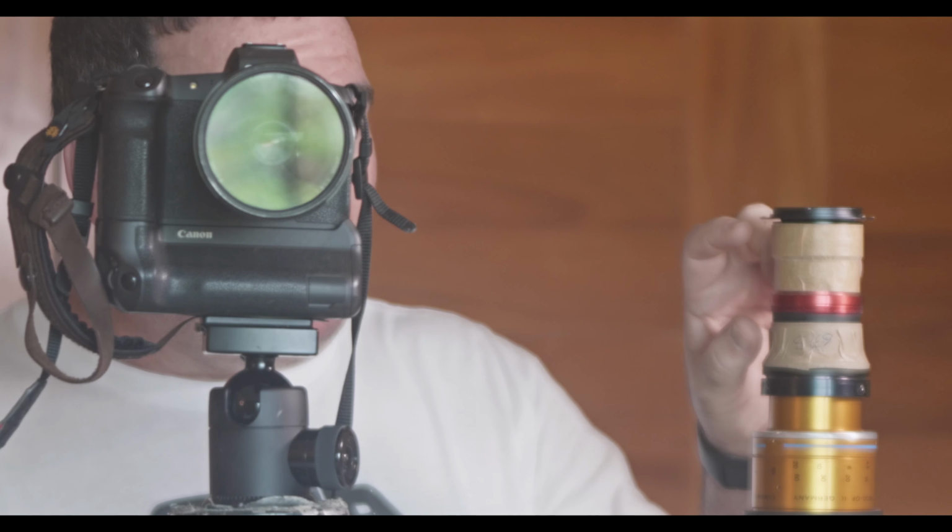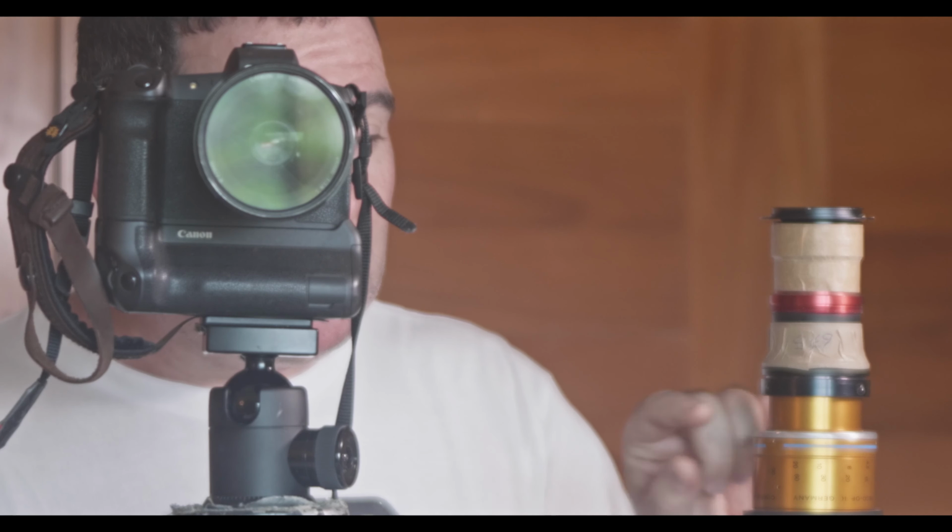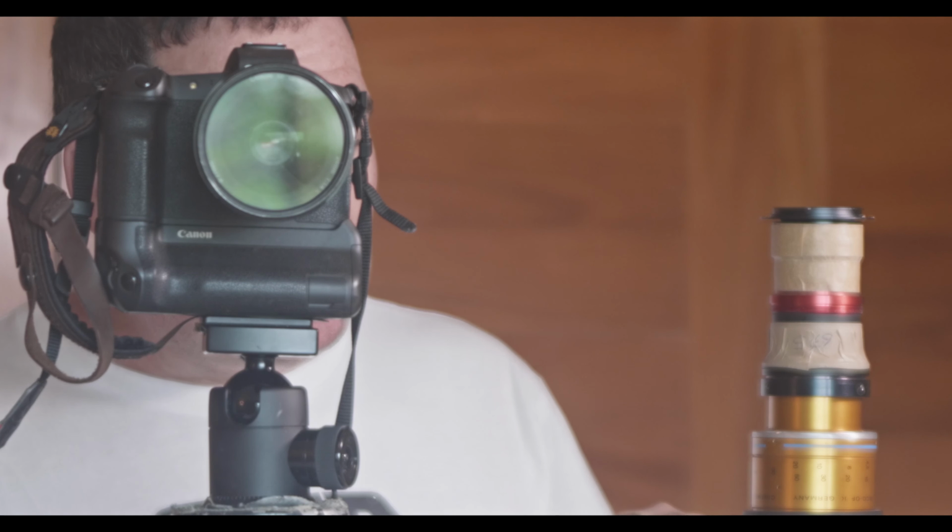So even though from time to time, when you're using one of those lenses, even if you're not disassembling with frequency, slight deviations in the tolerance might generate a bit of a compromise in the optical quality. Mainly what I'm talking about here is the infinity focus on the spherical element, and the second problem that arises more frequently is the misalignment in the anamorphic block. Some problems could also happen in the single focus solution, but I think that those are really less frequent,